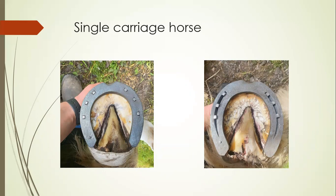If we're really looking to apply grip, tungsten pins can be used — as seen on this horse, there's one in the lateral heel. They can also be applied one to each heel, or two in the heel and two in the toe area. These tungsten pins provide sufficient grip without elevating the hoof. Care must be taken whether applying a single pin affects the medial lateral balance over a long period. The least interference we can make with the shoe package in terms of extra grip, allowing the hoof to function and slide normally, the better.